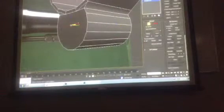Again, this one I don't need to measure so much. I'm just going to get it as close as I can. Spin it out 90 degrees and bring it in here. I'm going to make sure that it's at 105 so that it lines up with the exact center of this one, right across here. So I know that this shape here is going to end up being this pin. So now, I'll go and remove this edge, and this edge, which are the same thing.